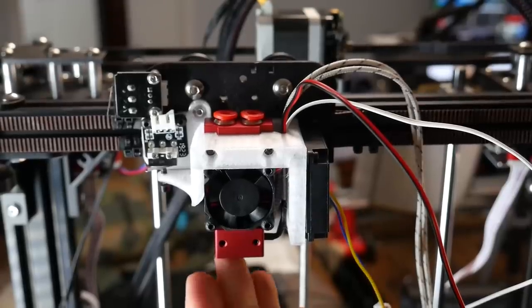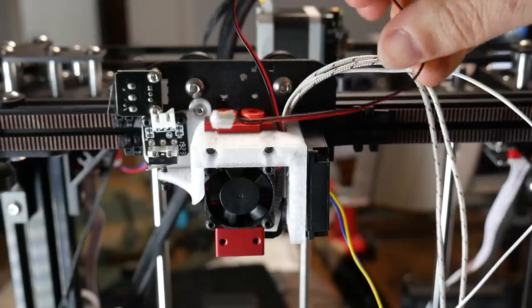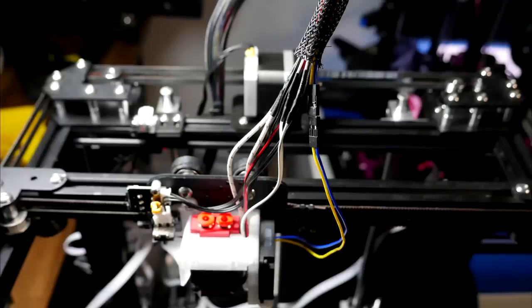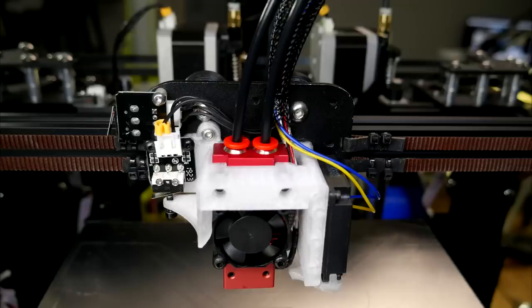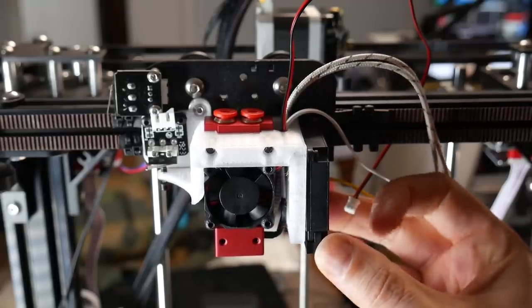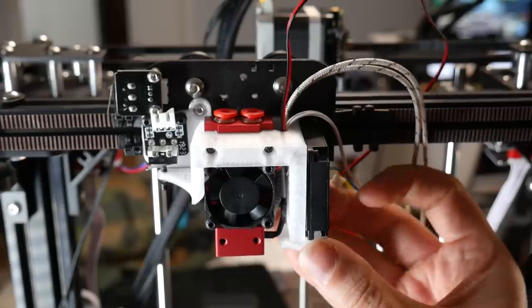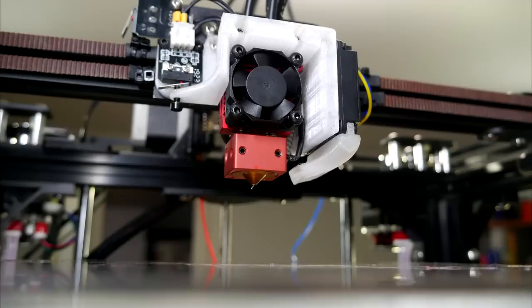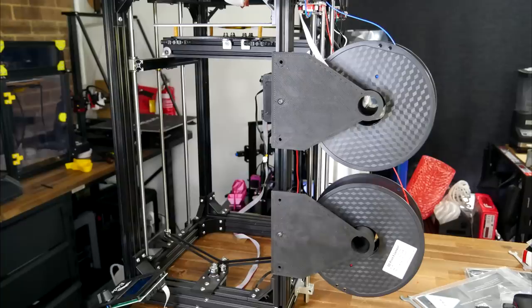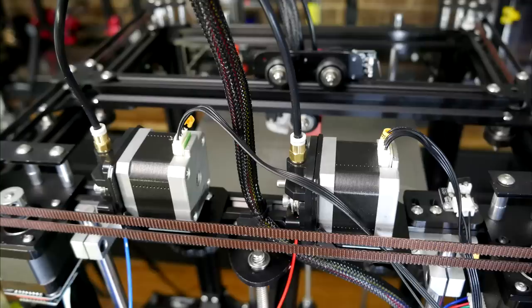Here it is on the printer, with a suitable amount of flex to trip the microswitch that runs the ABL. All of the wiring is routed in the correct location, but unfortunately none of them were long enough. Therefore, I decided to cut, solder and heat shrink them into the original wiring loom. With all of the cable management back in place, it ended up looking pretty tidy. The new mixing hotend is quite a bit longer, which means the factory part cooling fan duct is pointing right at the heater block. Again, I took to CAD and modelled up a quick solution. I'll add the file for this one on Thingiverse — it's not perfect, but at least it gets the airflow in the ballpark. As for the rest of the physical install, it was actually quite straightforward. The two new filament holders bolted nicely onto the back of the frame, and there was plenty of room across the top of the frame to add in the second stepper motor and extruder.